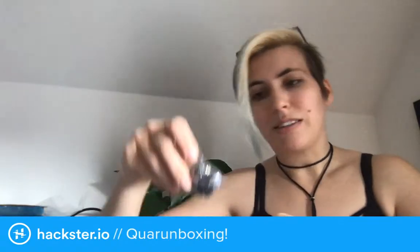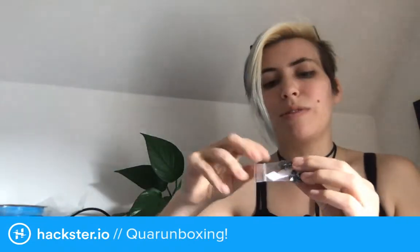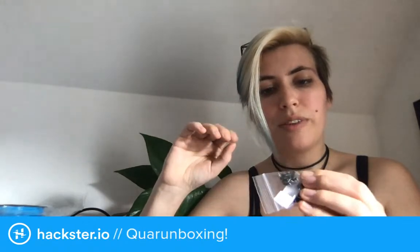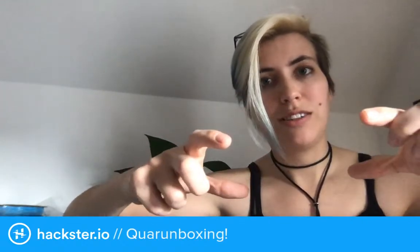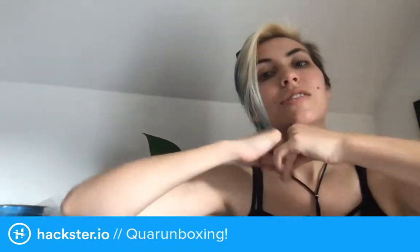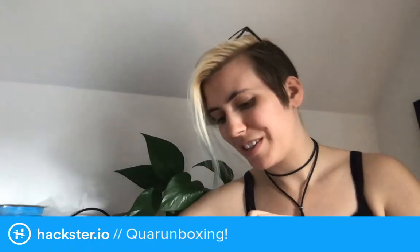And then a bunch of tiny little buttons. And I've noted on a piece of paper, with these little buttons, sometimes you don't know which way they connect. Usually one pair of the 4 pins is connected, and in one direction they're connected, and in the other direction they're not. So either the ones across from each other are connected, or the ones next to each other are connected. And then you connect one from each pair in order to make the button connection happen. And so I've written down which version those are.